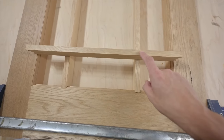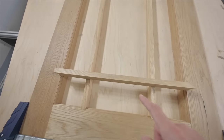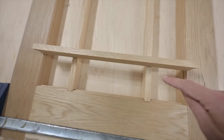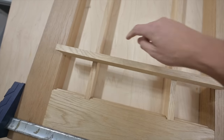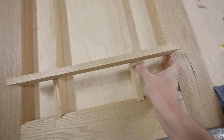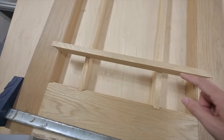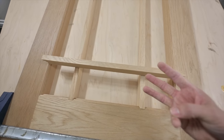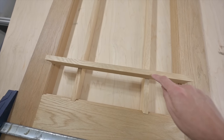You can see we have a point of intersection here, one here, and then two more at the top which is basically a mirror image of what you see down here. What needs to happen is this needs to stay a solid piece of wood, and these two also need to stay solid. I'm not going to just cut this and piece it in inside this little panel. These are going to remain solid, they're going to intersect, they're going to miter, and they're also going to be half lap. We've got to accomplish all three of those tasks in this little muntin bar.